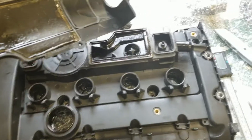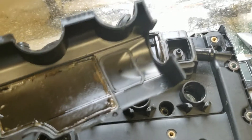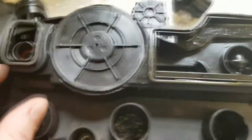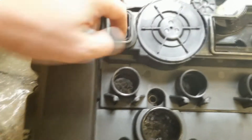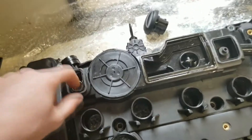I'm going to glue this back on. I'm not quite sure what glue exactly I'll use right now, but it needs to be airtight and make a good seal around those pieces. Thankfully these pieces actually look quite smooth where they've broken off, so I don't think it'll be a big issue once I clean it up and degrease it thoroughly. There is another valve on this side and that one actually seems to seal okay — I put a little slip of paper underneath it and it grabs the paper when it's down. So that's okay.